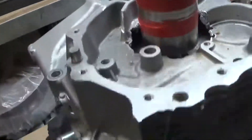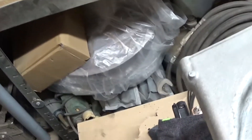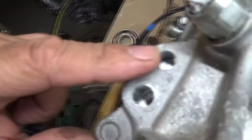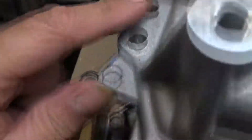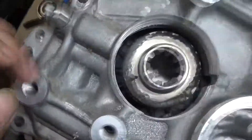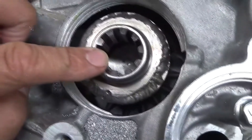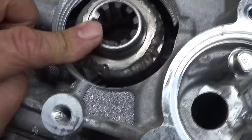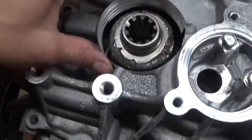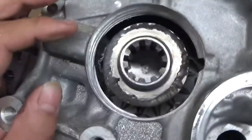I've put one of the locating dowels back in there — it's actually quite a good idea because it stops the shearing force. So if you drill the holes a bit big, if I can get the locating dowels centred first on the aluminium plate then that should help with some of the shearing action. You can see the coupler there — I might even go a bit bigger than that if I've got a hole saw bigger. That's pretty much spot on there — I'm happy with that.